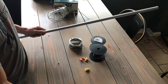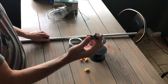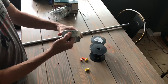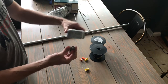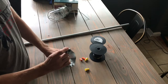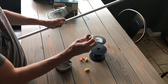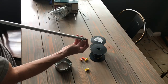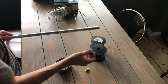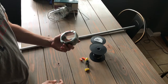You'll need half-inch conduit and set screw connectors for the conduit to connect to your box. These are very simple to use — they have a nut on the back. You knock out the holes in whichever direction you're going to run your conduit, put the threaded side through, put your nut on the back and tighten it down, then your conduit slides into the end of the set screw connector and you tighten down this Phillips head screw. It just holds the conduit in place, keeps everything secure to your box so you don't have wire showing or anything getting pulled apart.